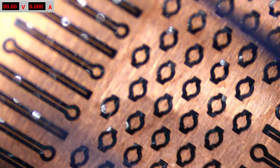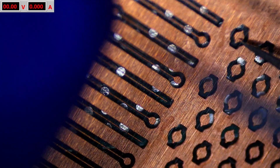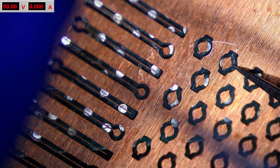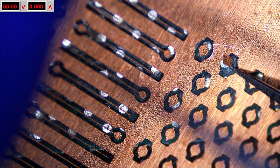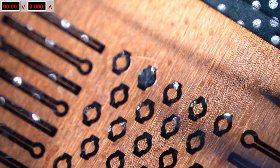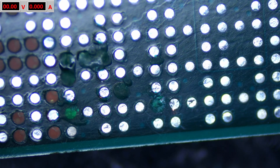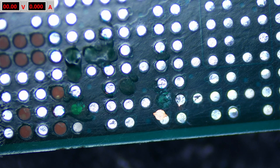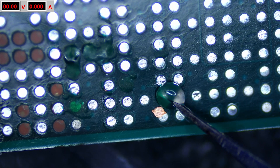I think I'm going to try using one of these pads because it has a little fin on it, which is perfect for soldering to that kind of thing. We'll compare the size of it to the other solder pads here — you can see that's pretty much the exact same size, maybe a little bit bigger, but that's perfect. So first I gotta get one of these off without losing it, and it looks like I managed to get one off.